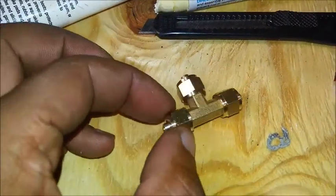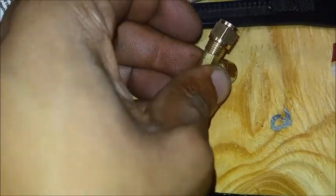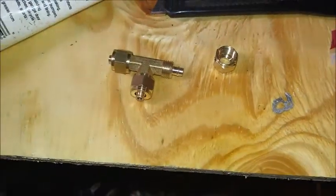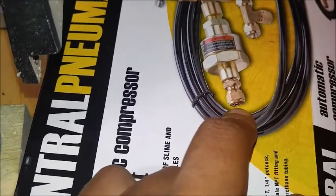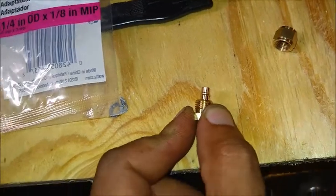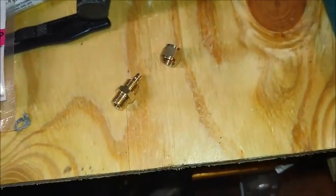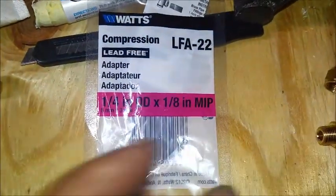The one that comes with Harbor Freight is set up for plastic tubing, so you can't use it with brass - I couldn't anyway. If you figured out how, leave me a message. Then down at the bottom, the special purge valve was already set up for plastic. I had this part that I couldn't use because I'm still running brass - you can see where it's got the nipple permanently attached for the airline. I had to buy the compression style with the correct threads.